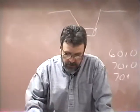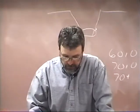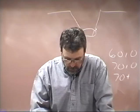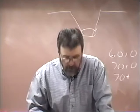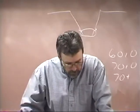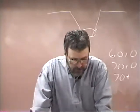So before you start again, you're going to clean it up, clean that bead up 2 inches back, and then start again. Read about tie-ins. Read about preparation for the hot pass. Then on page 116, highlight this, the hot pass.